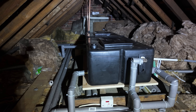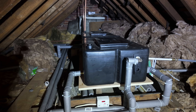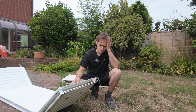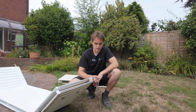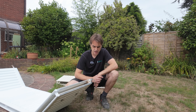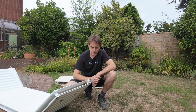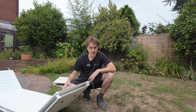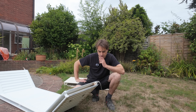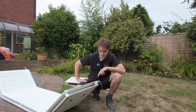The reason is there's no visible stopcock and no visible mains pipework going to the house anywhere on the ground floor. Having only three to four litres per minute flow left no other choice than to put a cold water storage cistern back in the loft and go back to a vented system. We have no flow, no pressure, and we won't be able to properly flush or power flush the system either — we're only getting two to three litres per minute, so we can't even mains-flush the radiators in the garden.